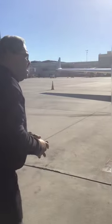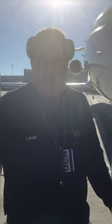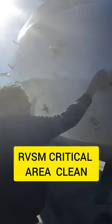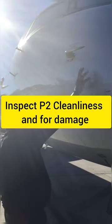Back off a little bit and take a look at the RVSM area along with the windshield. Most of the windscreens will be dirty, so let's be courteous and clean those windshields off to avoid calls in the morning. Every latch we want to make sure is secure. The RVSM critical area has got to be clean — no dents, no scratches. This is your pitot-static tube number two, PS2, and we want to make sure these tubes do not have any contamination, bugs, or dirt. This one looks pretty clean.